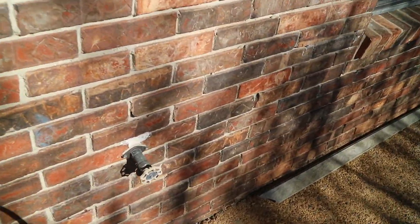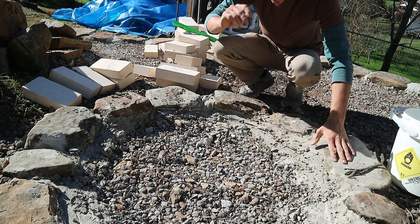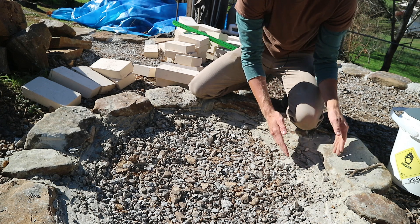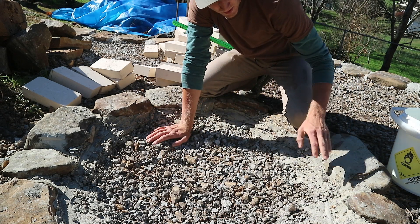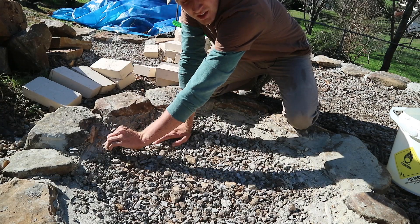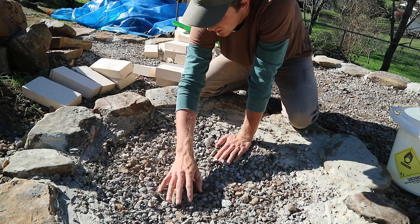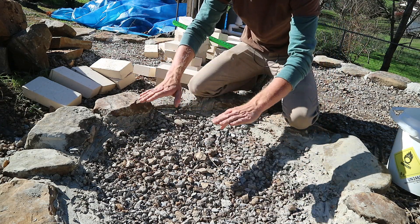For this mortar mix we need to get some water. First things first — we have this base already all the way around, but we need to create a leveled-out area about two inches off the inside of these fieldstones, coming all the way around with crusher run, so that we have a solid base. Press that down, compact it down, and then we'll have a layer of mortar and we'll lay the first layer of bricks. The first layer of bricks is the key ingredient to making this all work — it needs to be completely level. So we'll get the crusher run first, then put the mortar down and use that mortar to make the first layer perfect.